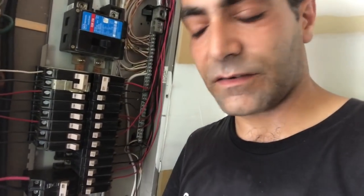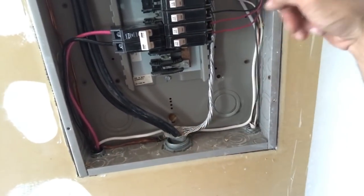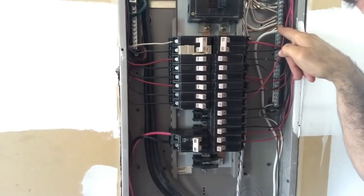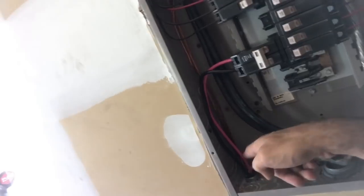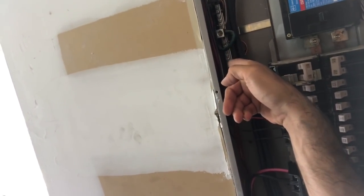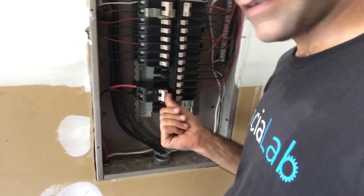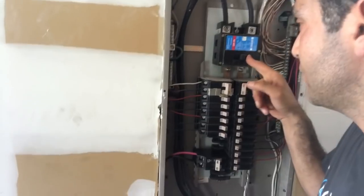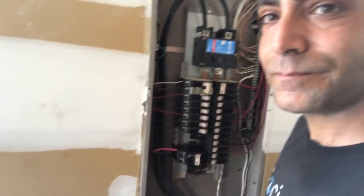Some of this wire was hard to work with but I got it all in place. You can see our six gauge wire came through here - I ran the neutral up to the neutral bus up here, found the spot for it. The red and black hot leads both came into each pole of this breaker, wrapped up nice and tight along the sides. The ground ran all the way up to the ground bus. That is the default Tesla configuration they ask for with their mobile charger. We can turn the service back on now as long as our breaker here is turned off. Lights are back on and we can continue.